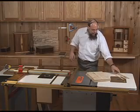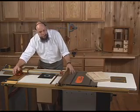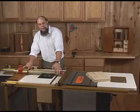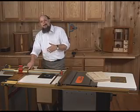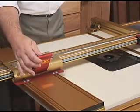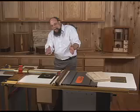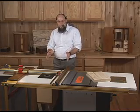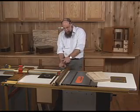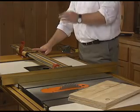The mechanics that make that accuracy possible are very simple. An INCRA positioner has three moving parts — one more moving part than a conventional rip fence. Right up here on the front of the carriage, there's a three-and-a-half-foot-long steel lead screw, rolled out with 32 threads per inch to match the fractions we plan our projects in. There's a high-pressure clamp that drives a matching set of those steel threads so that every time you lock it down, those threads mesh and cause the fence to instantly center up on only the closest perfect 32nd inch. And it won't let you miss by more than two thousandths of an inch. In other words, instead of you tapping the fence and trying to line up the lines by eye, when you lock an INCRA positioner, it will line up the line on the cursor and the scale for you automatically.